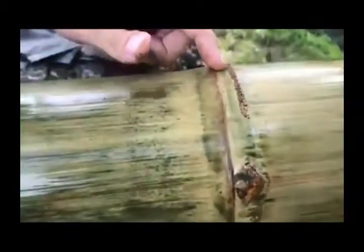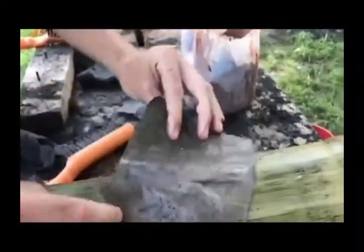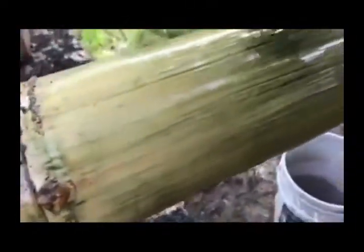We use this over the internodes. The internodes are the part between the nodes, and the Asper dendrocalamus has this extra growth here, so we take it down and file it down a little bit. Then we also use very fine sandpaper, 120 grit, and then a sand which is a little grittier, and we sand it down, taking off some of the marks. Later, when we wash it and clean it off, it becomes very nice, cleaner and finer.